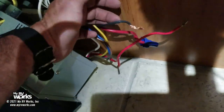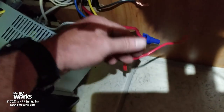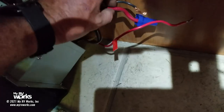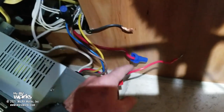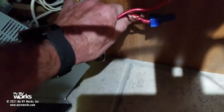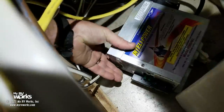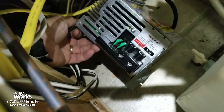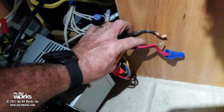on my tow vehicle, the truck where the truck is connected to the seven-way. So that when I'm driving down the road, 12 volts from the truck is energizing this, charging my battery as I'm driving on the black wire. So therefore my battery, this big one's the battery. This is the battery from the truck towing it. This is coming from the converter. They can all be tied together, and they can all be tied into, where are we at down there? Let me get my hand in there, the plus on this. So there we go. See the big red plus right over there? So those all are going to be tied together, making the converter an integral part of my battery system. They're all tied together as the output of the converter.